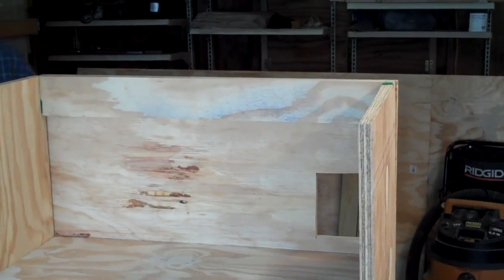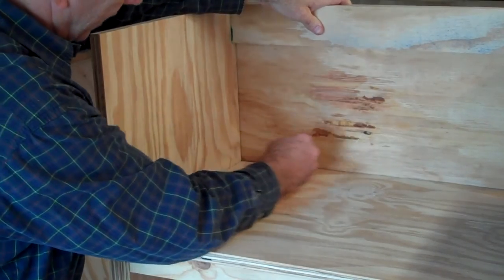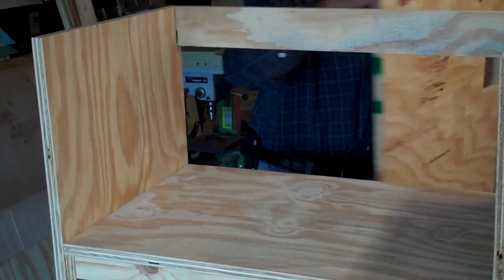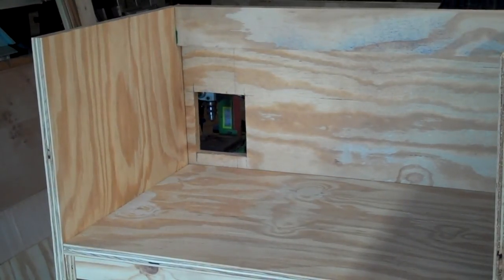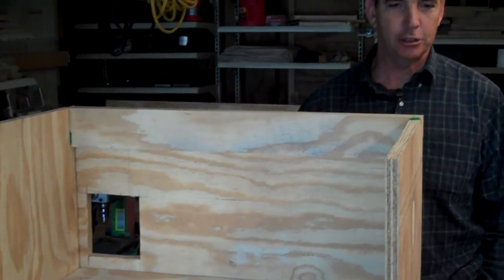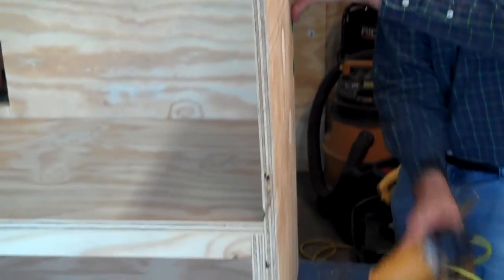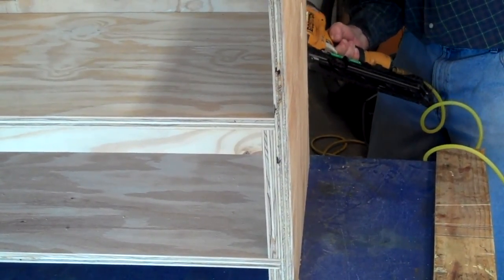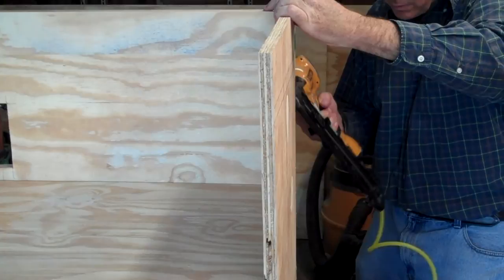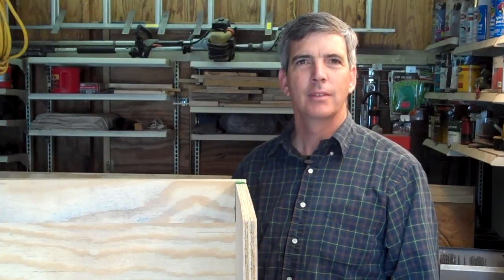I've got one other trick for you. I want to put a couple of nails into this shelf on the back. The way that I do that is I put a pencil line on those two shelves, then flip the back around so I have where those shelves are, and I know to come down a little bit further and I'll be right in the middle of that three-quarter inch shelf — and that's where I'll shoot it. So let's square this carcass up, bring it right to the corner, and walk it along its edge. That's all there is to it.